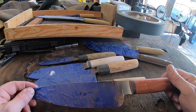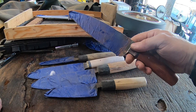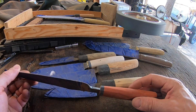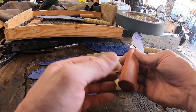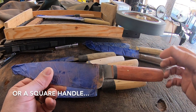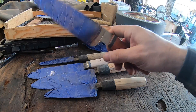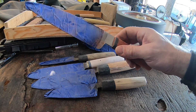The first thing I would bring to the front here is the natural indexing of a knife handle. What I mean by that is the user should know where the edge is on the knife at all times when they're gripping it. One of the simplest ways to accomplish that is with some form of an oval type cross section on a handle. The total opposite would be a round handle, in which no matter where you're holding it, you're not going to know where the edge is. A nice oval cross section means you'll know exactly where the edge is as you're using the knife, and it makes for a much better experience for the user.